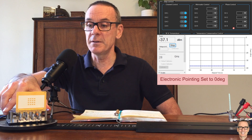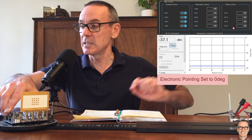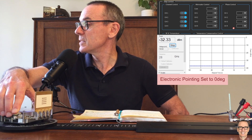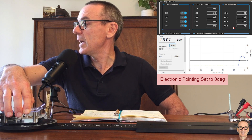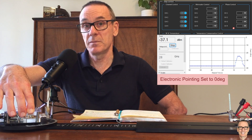This means that our antenna is radiating with a beam that is going straight out perpendicular from the array. So as I turn the array around now, we will start seeing the gain rise because the receiver is over here. And as I do this, let's see what happens. The gain starts coming up, and then we go through the perpendicular and it goes down again. And so this is the beam shape that we're seeing.